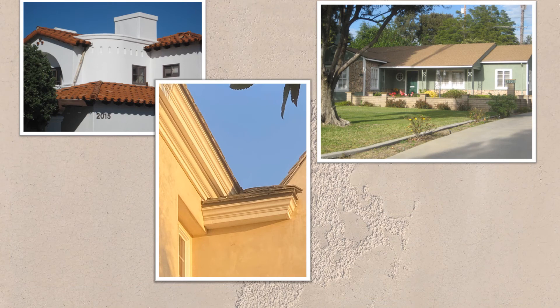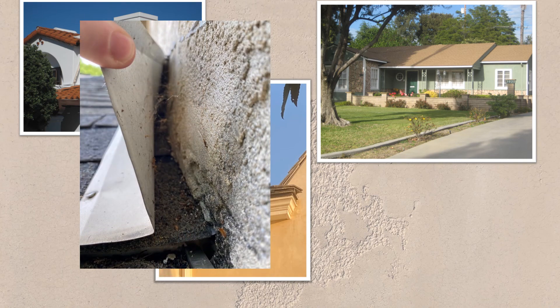The SMA always recommends kick outs as well as other trims, but lacking these items does not mean automatic failure and should not be the reason for the sale of any home to fall through. You need to assess each home and its location on its own merits. For example, that surface-mounted Z-bar on a northeastern home? It turns out they have never had any signs of water intrusion or problems. So noting the lack of a kick out is certainly appropriate, but so too is the fact that no issues have ever been noted.